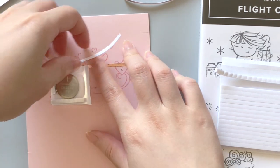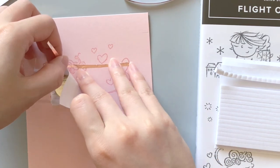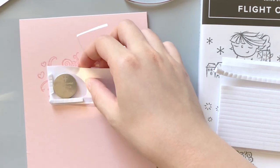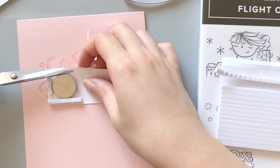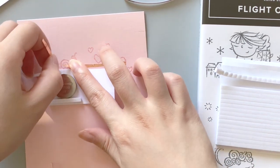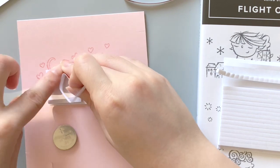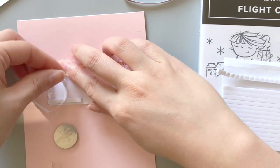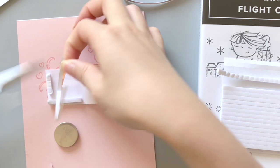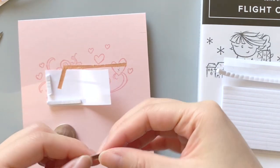You really only need to follow one rule: you need to connect the positive side of your light to the positive side of your battery. After you're done, then you can do the same thing to the negative side. In some cases you might need to make turns with your copper tape, and it does take a little bit of practice to master a very sharp corner, but it's really not that complicated. What you need to do is pull the tape back, kind of folding it back on itself. Then you can use a tool or your nails and press down the tape at a 45-degree angle. Once you create that 45-degree angle, you can redirect the tape in the direction that you want.